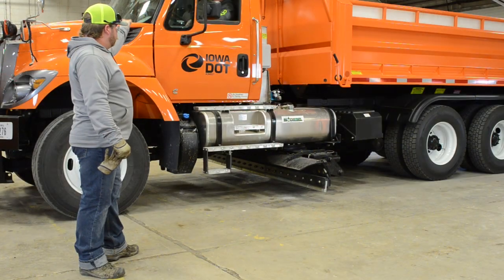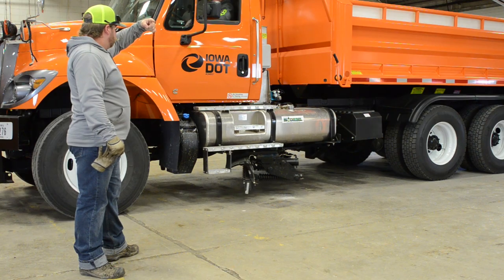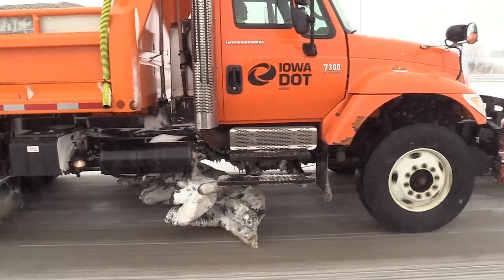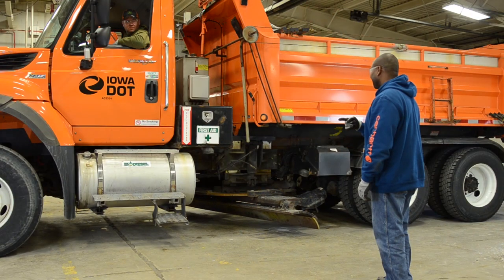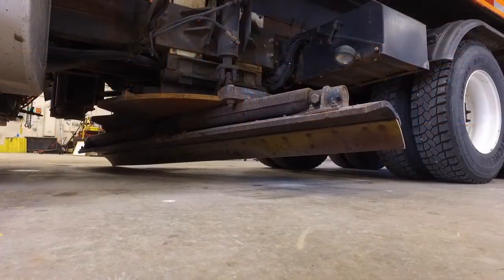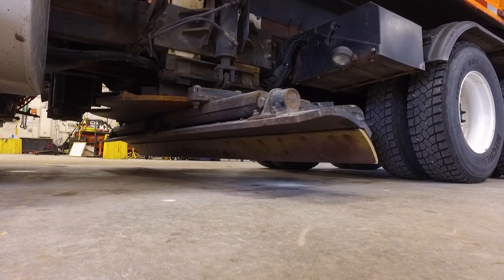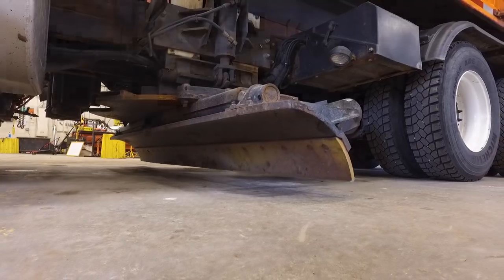Mounted on medium-duty trucks, the high-speed underbody plow is used to pick up snow that the plow leaves behind and clean up hard-packed snow from the roadway. The high-speed underbody plow should not be confused with an ice blade, which applies much more downward pressure and increases the amount of wear on the pavement. Controls move the blade up and down, turn it left or right, and lock it. Some of the older model high-speed underbody plow blades can also be curled forward or backward.